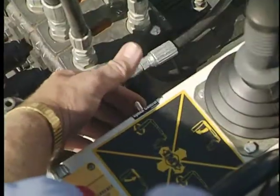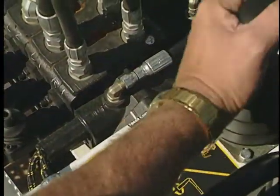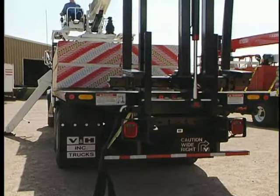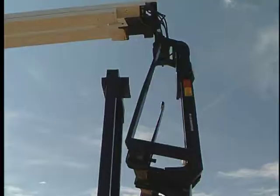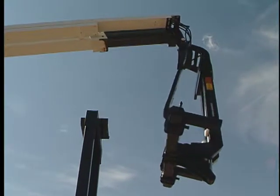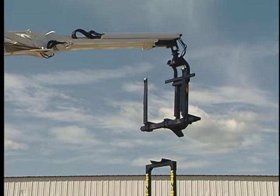Next, check speed control from automatic to idle RPM by listening to the variation in engine sounds as RPMs fluctuate between control settings. Now do a simple move with the crane to make sure it is operational. To raise the boom, first raise the inner boom and run the extension out to get clearance. You are now clear of the fork housing.